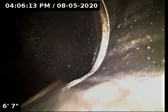And just inside the door here, we have a 3-inch ABS cleanout. We're going to insert the camera and check the overall condition and serviceability of the sanitary sewer line. We do have water running, and we may have to do this one in parts and pieces. It's a very awkward access point with the turn here and this water line sitting right over the top of